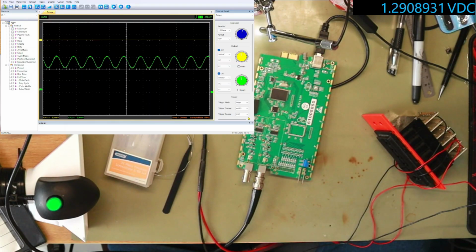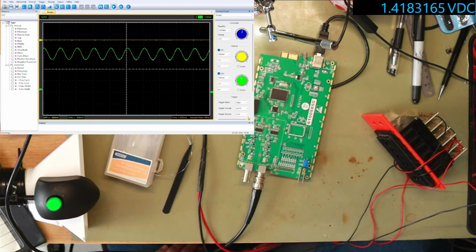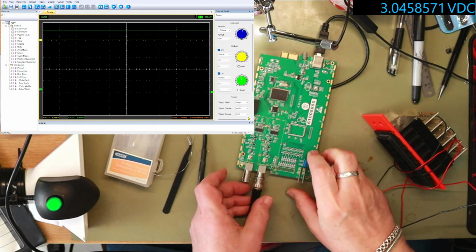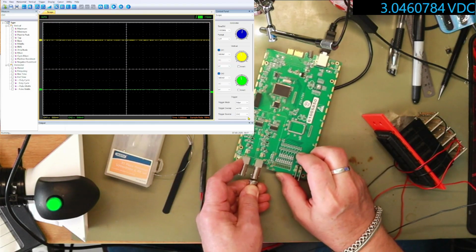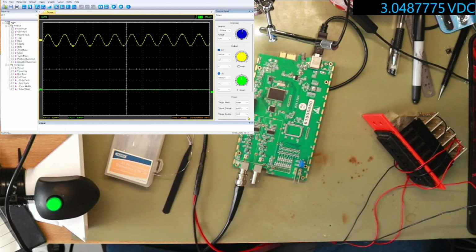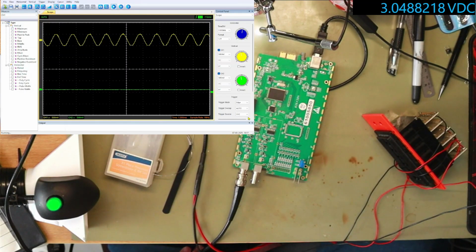And so if I was looking at a signal on the output that's not DC coupled with my transistor circuit, and say it had 5 volts on it, well, there you are, 3 volts on the 500 millivolt range, and that's what you see. Now I move it over to channel 1. Look at that. Back, smack bang, either side of the 0 volt setting, doing what you want with a scope.